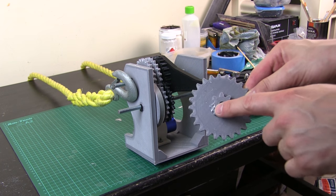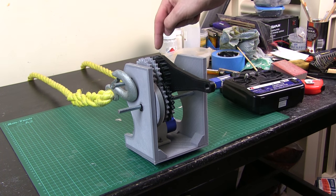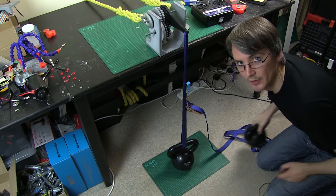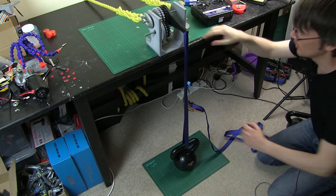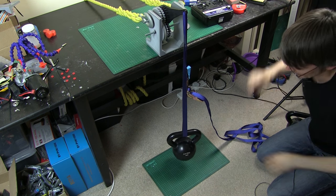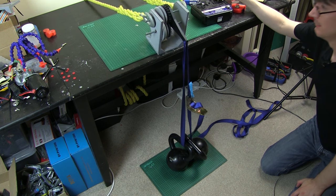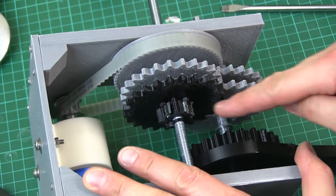The teeth haven't quite snapped but they're starting to get slightly indented. The motor driver is getting pretty hot — it's only a 30-amp driver and the motor's maximum is 80 amps. But it felt pretty tough, so let's do a strength test. I minced that gear — the teeth are actually broken — so I've printed a new one in black at 100% infill with a wider little gear to mesh properly. I've attached it to a tow rope tied around a parallel bar on the table with the lever facing off. The first test is an 8-kilogram kettlebell — let's turn it on.